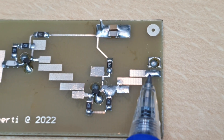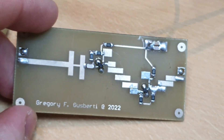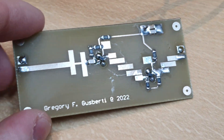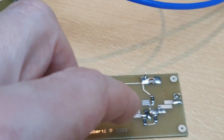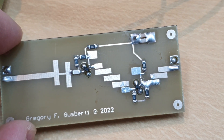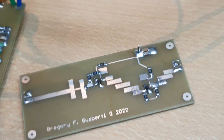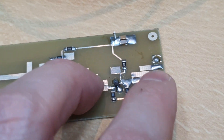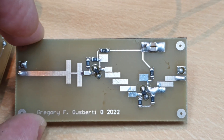The output has almost zero dBm. This module would probably be better made with a better substrate — this is FR4, which is not ideal for high frequency. At 3 gigahertz it works fine; the losses are high but manageable. But for 10 gigahertz it would be beneficial to use Teflon or a better material. However, FR4 is what I have in the lab, so we're making it with FR4. Zero dBm is good power at 10 gigahertz. After the project is completed we can easily redo this module in a better substrate.